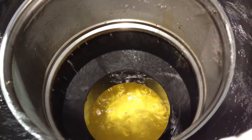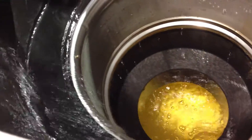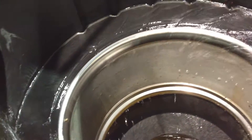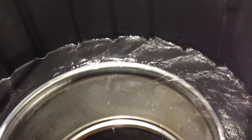As the water spins, it will pass over the vertical stainless steel filter. Any leaves or debris that may be in the water are going to fall straight through the filter and out of the overflow line. The water will be pulled through the filter by capillary action, and the clean water will go to the cistern itself.